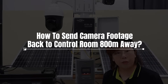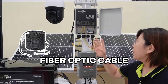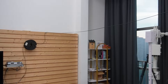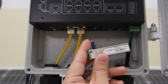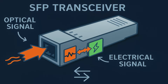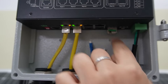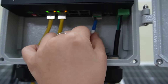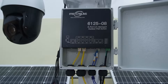Now, how do we send the camera footage back to our control room 800 meters away? We decided to use fiber optic cable. You can see the fiber optic cable linked from here back to our control room. Now let's connect the cable to our switch. To connect the fiber optic cable, we need an SFP transceiver. This module converts the optical signal back to electrical so the switch can process it. Let's plug it into the SFP slot — this switch has two SFP slots. We're using a two-strand pre-made fiber optic cable. Let's use strand A, plug it into the SFP transceiver, and our data is now transmitting from the fiber optic cable to the control room.